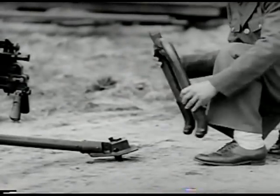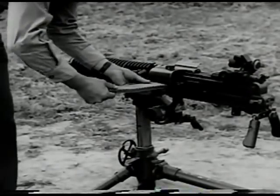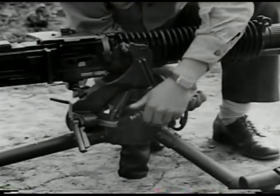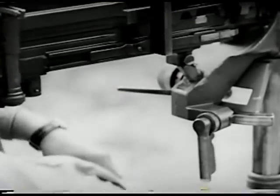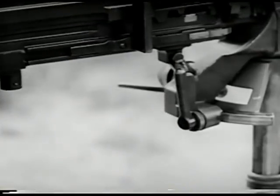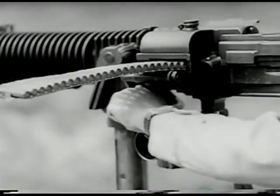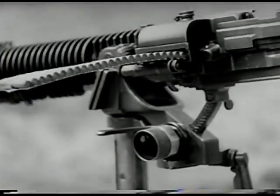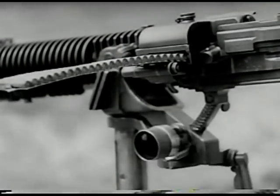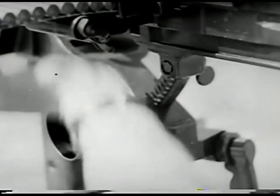To get it into action, remove the tripod carrying arms, then insert the 30 round plate charger into the feedway. The cradle elevating mechanism is unlocked by turning the lock handle one quarter turn, freeing the wheel which lowers or raises the cradle. To traverse the gun, squeeze tightly on the traversing lock handle, then turn it counterclockwise a half turn. There are two ways to elevate and depress this weapon: manually by unlocking the elevating hand wheel, or mechanically by locking the mechanism and turning the elevating hand wheel.